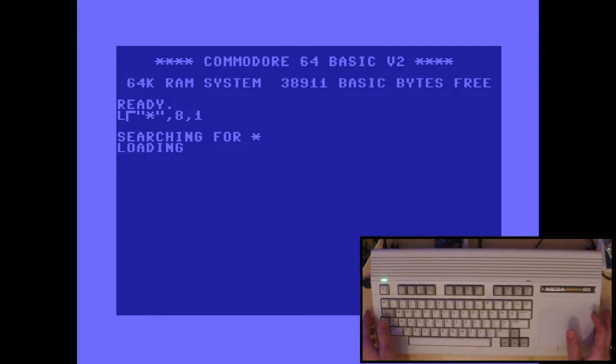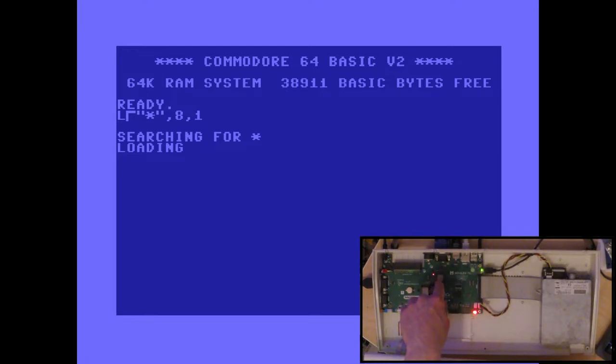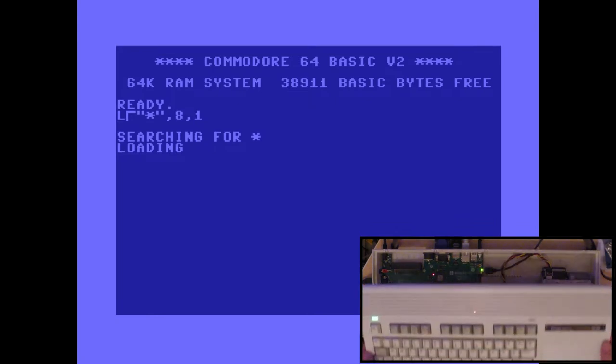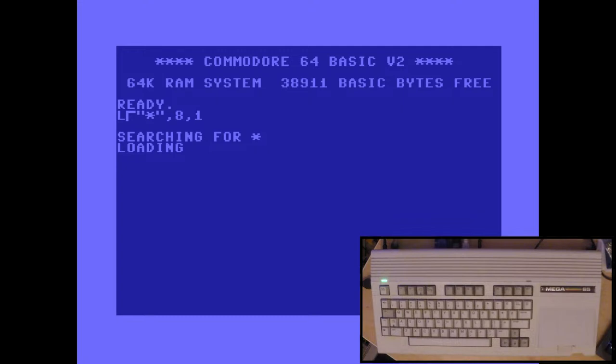So essentially, this is this cable here. This is the FTDI programmer with which I can program the FPGA, but which also has a serial controller, which is used by the kernel. So I can open some terminal like PuTTY, and then I get a text-based controller. And this was the way to mount disk images